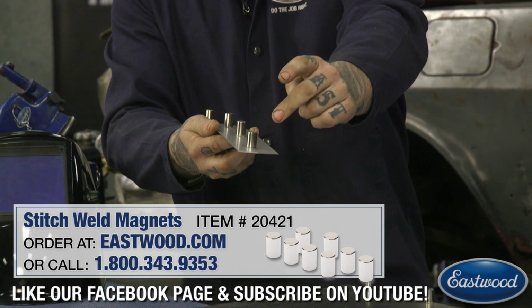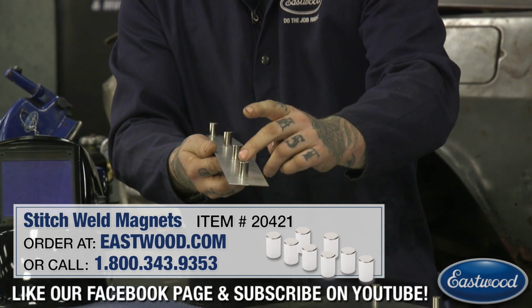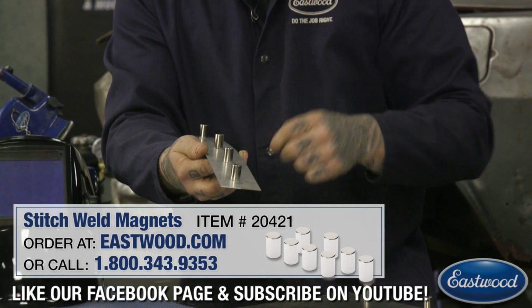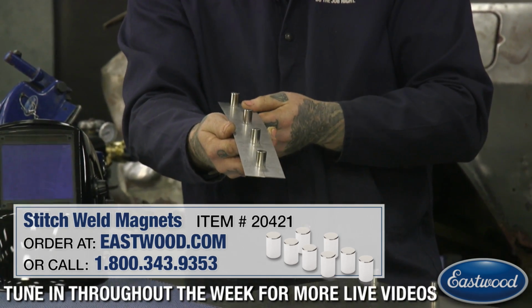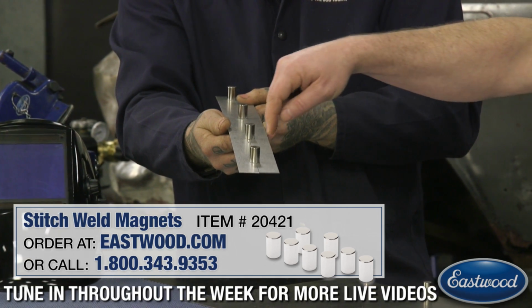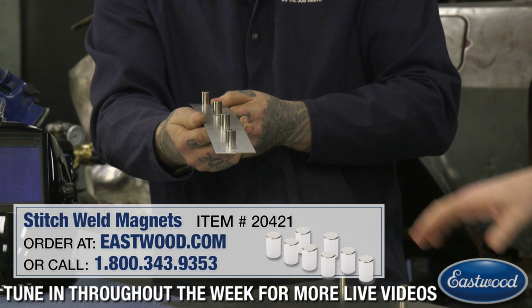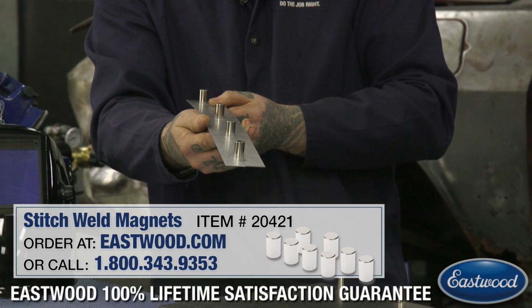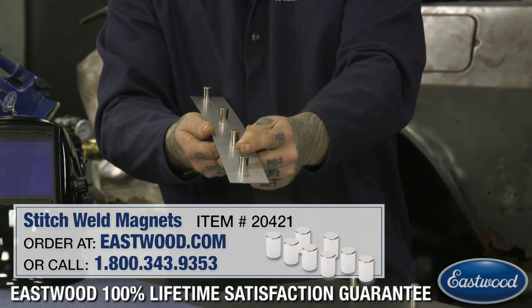So you can use this and stagger. We can do a couple stitch welds here, jump, do a couple there, and then come back and move our magnets around. It's strong enough that it can pull sheet metal into shape. A lot of panel holding systems go down in between and hold the panels together, and a lot of people don't want that gap. Yeah. So this is going to make it butt up perfectly. You get that perfect fitment. It pulls it all together.